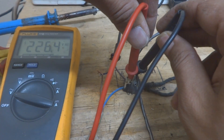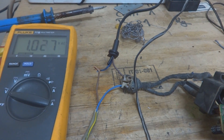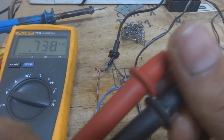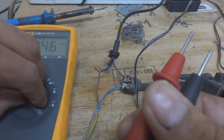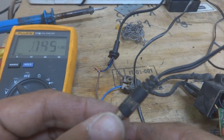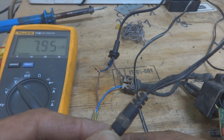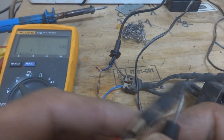Now electrified. Checking AC voltage — 226 volt is applied to the unit. The lamp is not drawing any current because this power supply is very low current, so the lamp stays off — that's a good sign. Now checking the output: inside positive, outside negative — reading is 7.9 volt DC. So it's about 8 volt DC — this supply has been repaired!